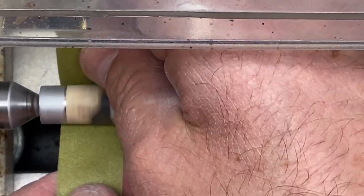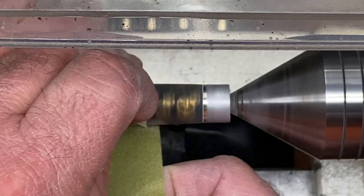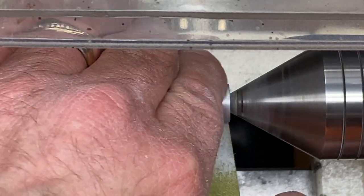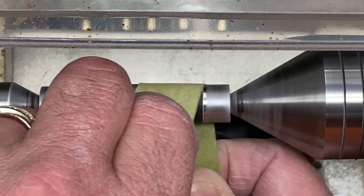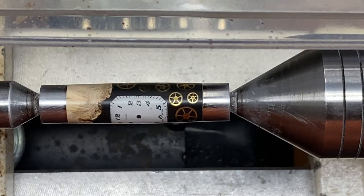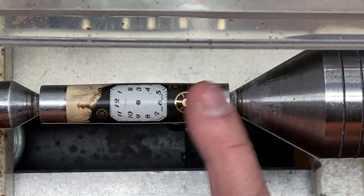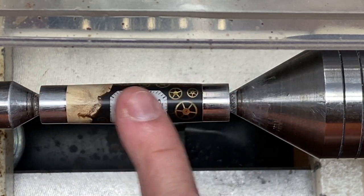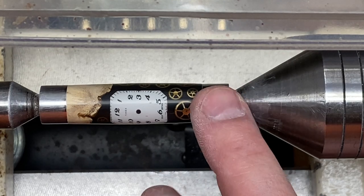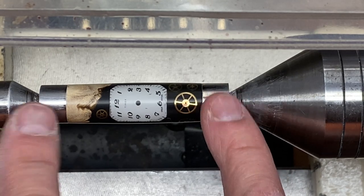I'm running at about 840 RPMs and I'm just going to use the zona paper from end to end. We're not going to stop the lathe and sand back and forth — we're just trying to buff out all of the end-to-end scratches on the blank. I get this zona paper from Turner's Warehouse and I'll make sure there's a link in the description to this video. I finished sanding with the zona paper and as I watch the reflection, I'm not seeing any scratches. I've got a super nice transition at my bushing, so I'm glad I went ahead and let the sandpaper clean that up. It's going to fit really nice against the components.